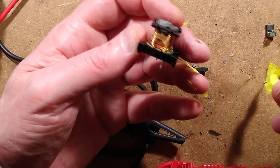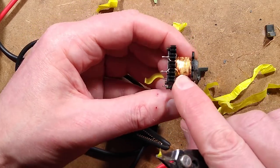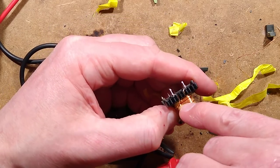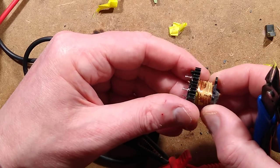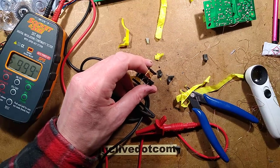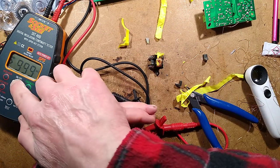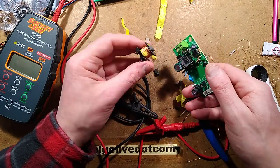Yeah, there's just no way to avoid that. That's filled up. The secondary is so filled up here that the wires are crossing right over where it comes out to the terminals. So I'd say that's it. But, to be fair, it did pass its 3,000 volt test, so that, you know, at least says something. But it's not a transformer that I trust.